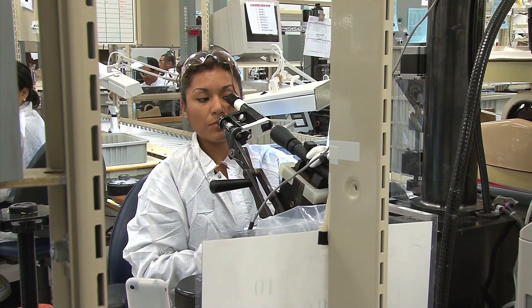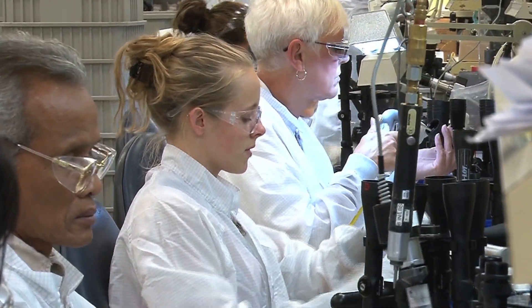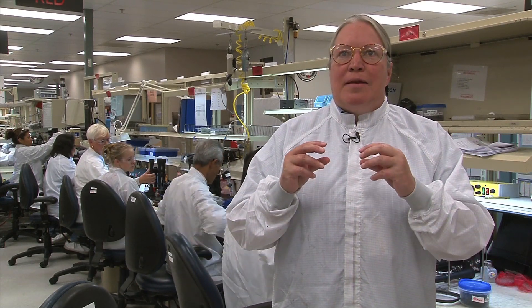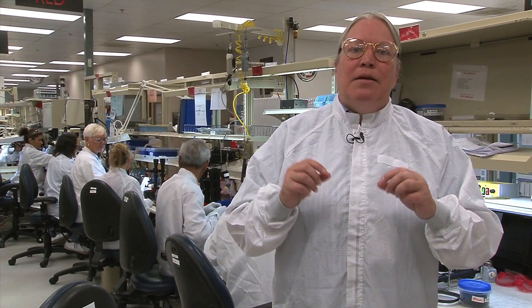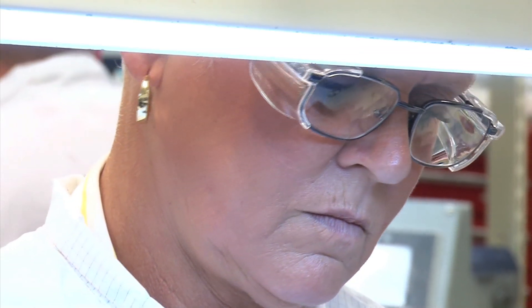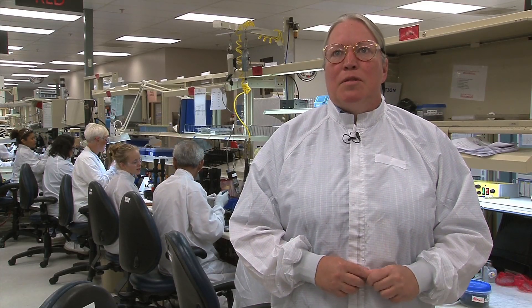The most important assembly is probably the erector assembly, which goes in the center of the scope and includes the moving lenses that do the zoom system. It's a fairly complex assembly that includes even more sub-assemblies underneath, like the erector lens assembly that puts the glass in each little holder and secures those very tightly so they don't rotate around and change point of aim as you use the product.